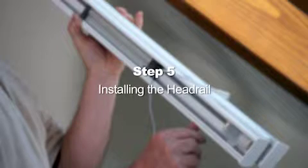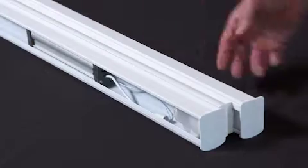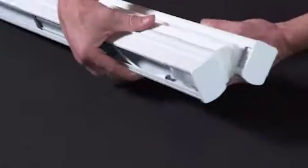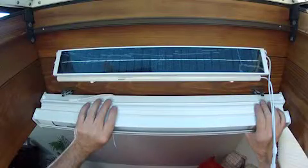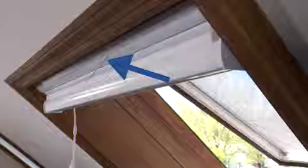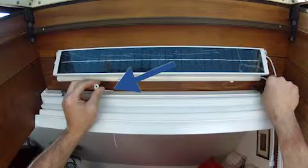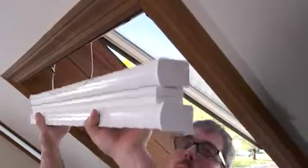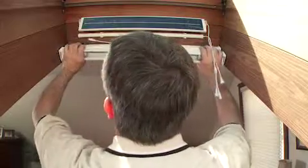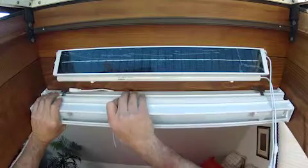Step 5: Installing the headrail. The headrail is the rail with the motor in it. The bottom rail is the rail with the fabric stack and the middle rail attached. Install the headrail first. Before mounting, make sure that the receiver wire is pulled out. For optimal performance, position the receiver wire so that it is facing into the room. Position the motor wire so that it comes out the back side of the shade, and be sure the motor wire is not pinched by the mounting bracket. Position the headrail with the front lip resting on the hooks of both mounting brackets, then push the headrail firmly up and toward the window until the groove on the rail snaps into place.